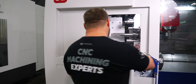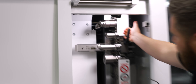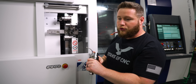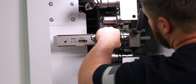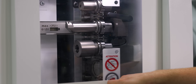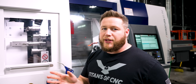It's actually pretty easy to change tools out as well. You just open this up, turn this handle, pop it out, pull it out. It is poka-yoked too — there's only one way this can go in, so it keeps your timing. Pop it in. The machine comes standard with a 20-tool ATC, but you can get 40, 80, or even 120 tools.